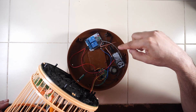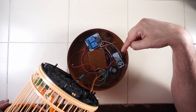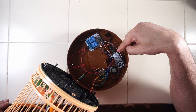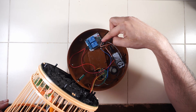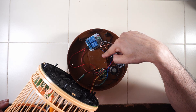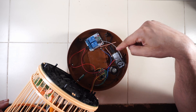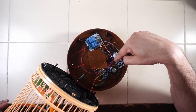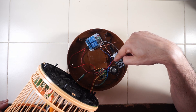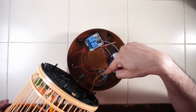The ground and VCC to the relay come from the ESP8266 5V and ground. The control signal also goes from the ESP8266 to the control pin of the relay. The toy works on three AA batteries, which is approximately 4.5 volts, but I have connected the 3.3 volts of the ESP8266 via the relay to the input of the toy.